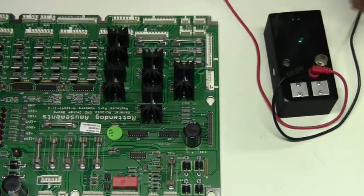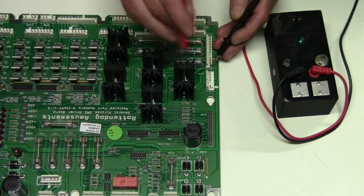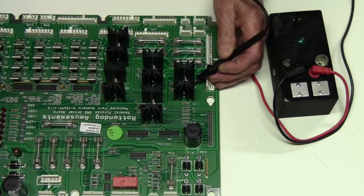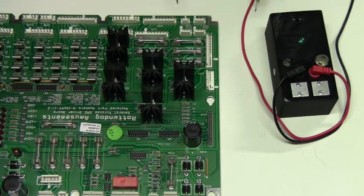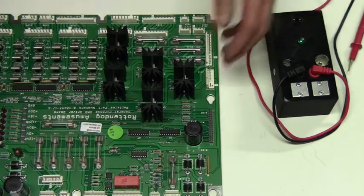So if I was having trouble with my purple string, I'd come down here and check continuity through this circuit and make sure everything is intact. I'll come here to pin 12 and the first leg on this track — I have continuity there. Then from the second leg on this track, this is Q12, and I come down to pin 6, right there. I usually just go to the outside one. Then I test my purple-white string — that goes from pin 10 to 11, and all the way to pin 2. We've got continuity all the way through there.